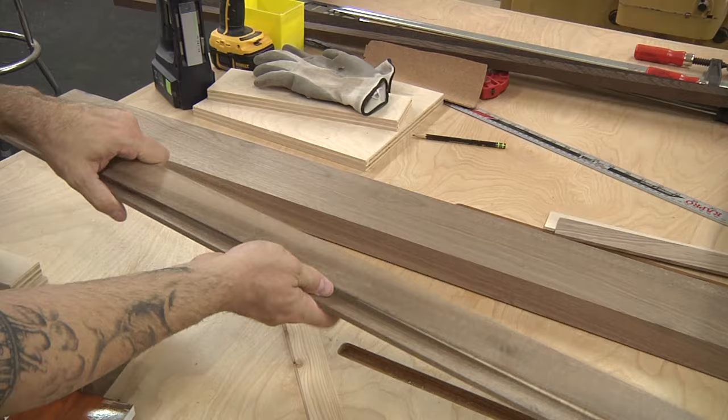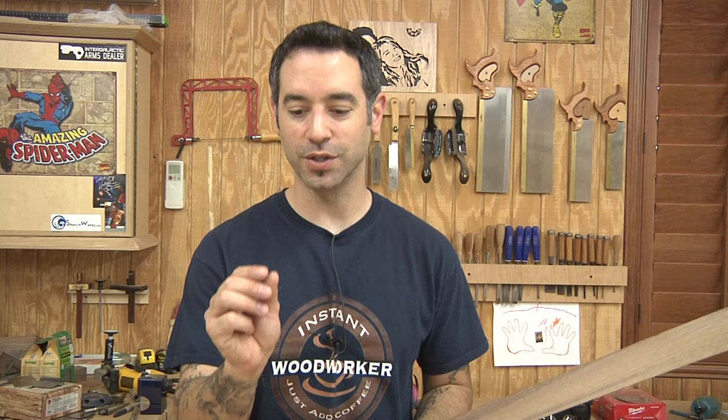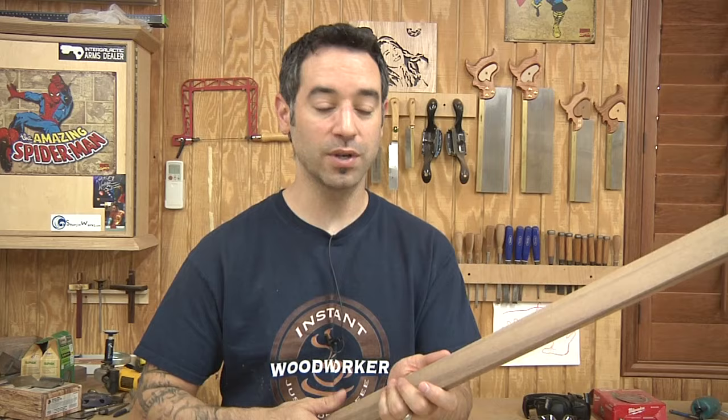You can see that using any one of those three methods, depending on the size of your work piece and the strips you need to cut, they all produce pretty good results. The band saw is typically where we normally do this task and it's great because the blade is so thin you can really save on material. The table saw has a thicker blade so you're wasting more, but you have the added advantage that right off the table saw, if you have a good quality blade, you really don't need to do much work to these at all. Maybe give them a light sanding if you're going to glue it to another surface, but it's pretty smooth right off the saw — so there's a big advantage to it.